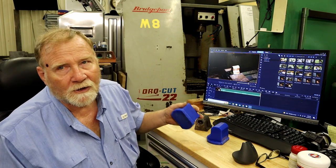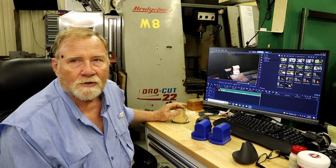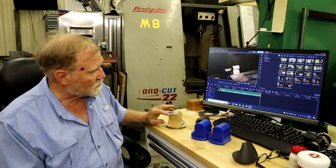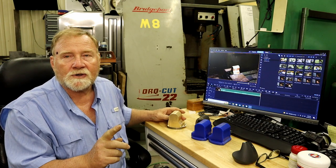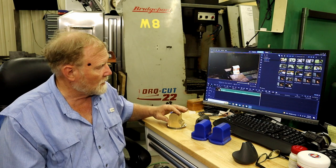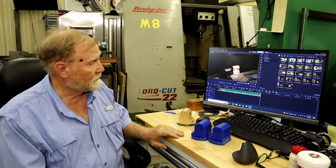It looks slow on parts of it, but especially on the wax parts, because I was only taking 30 thousandths of an inch deep cuts, mainly to get these steps where they weren't too big. And also I had a long stick out bit so I could mill all five sides at the same time, and I just didn't want to take too aggressive a cut.